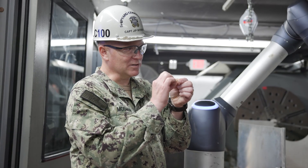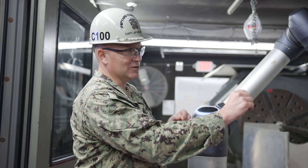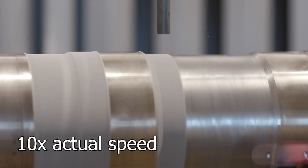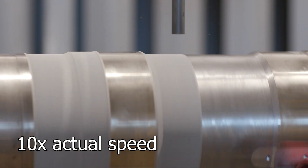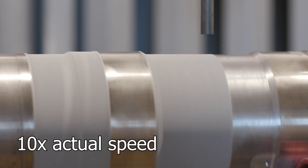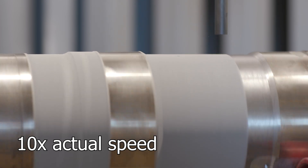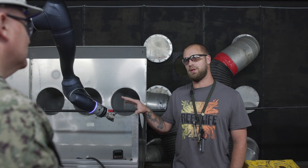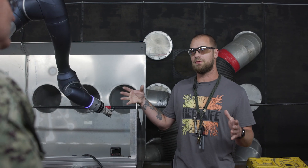You're talking a very small piece of metal at a very high rate of speed basically impinging upon the base metal, and the idea is that it bonds and sticks. It doesn't build up a lot of heat like thermal spray or welding would. It's just impinging upon it and they bond as the metal. Cold spray doesn't really introduce that much heat to it, so you don't actually bend or destroy the shafts or parts.